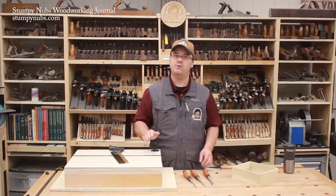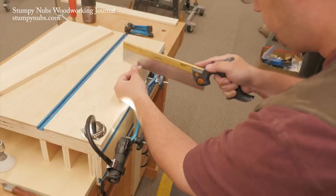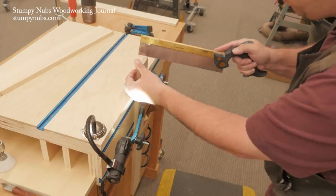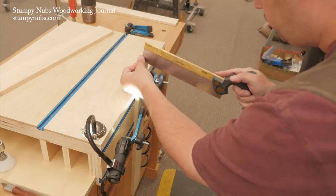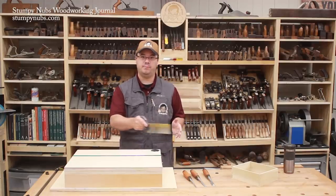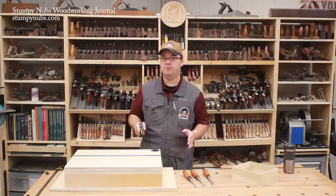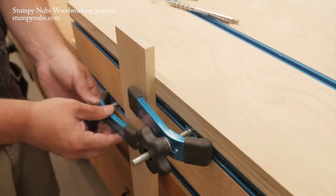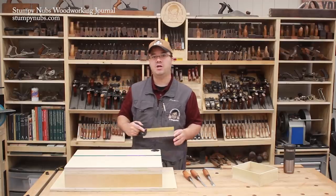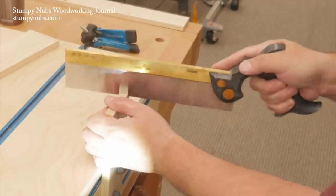Time to cut. Accurate dovetailing is all about getting comfortable so you don't have to turn or move your body in unnatural positions. That's why I like this workstation — it raises your work up where it's a lot more comfortable for sawing. I can position my body turned to the right or to the left depending on which side of the pin I'm cutting, so I'm simply pushing the saw forward rather than angling my arm. My only real concern is that I cut straight downward. If you can cut straight down, you can cut dovetails. I made sure to secure the workpiece perpendicular to the floor.